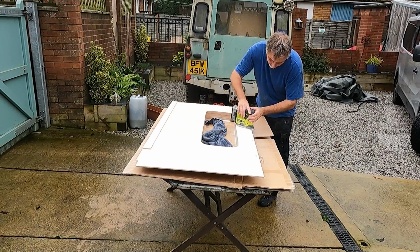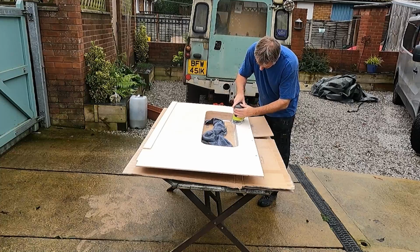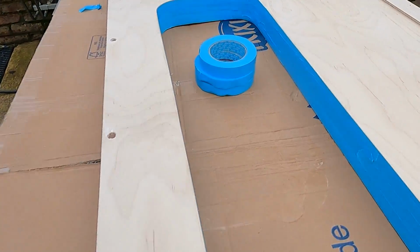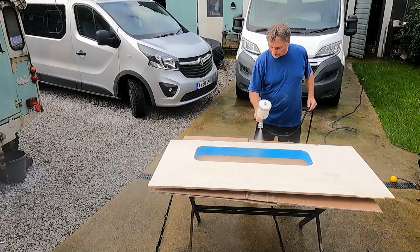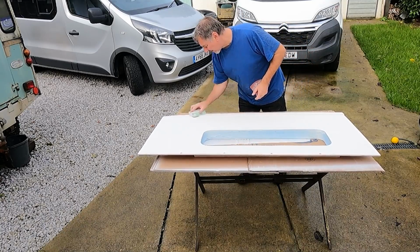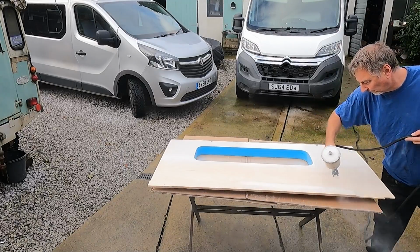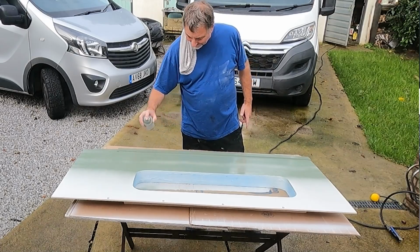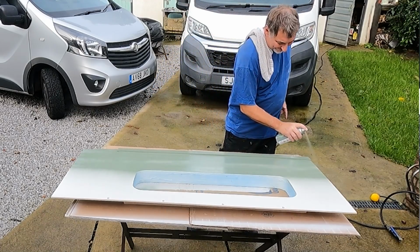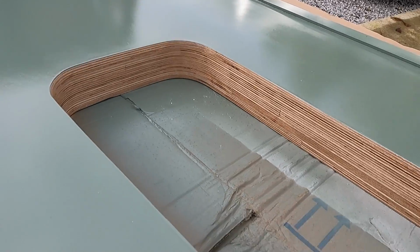Sanding with 180 grit removes all minor scuffs and gives us a good clean surface ready for priming. Masking tape covers the areas we don't want painting, then a coat of acrylic primer is applied. Once dry, we lightly sand to a smooth finish with 400 grit, before repeating the process with another spray and another sand. Happy with a good smooth finish, 2 coats of Rust-Oleum Sage Green gives us our final desired finish, and whilst tacky, we remove the masking tape exposing our contrasting colour and texture.